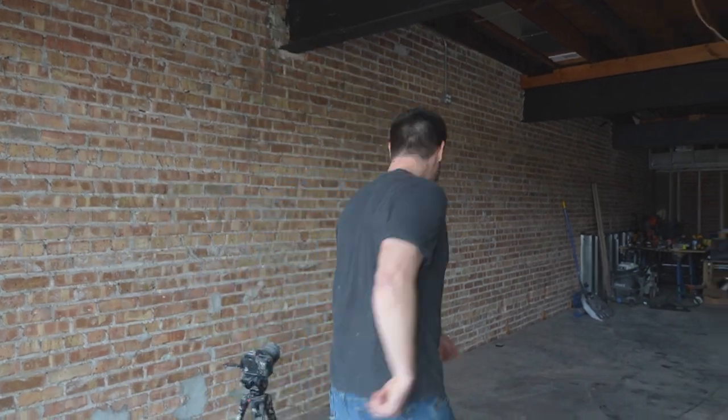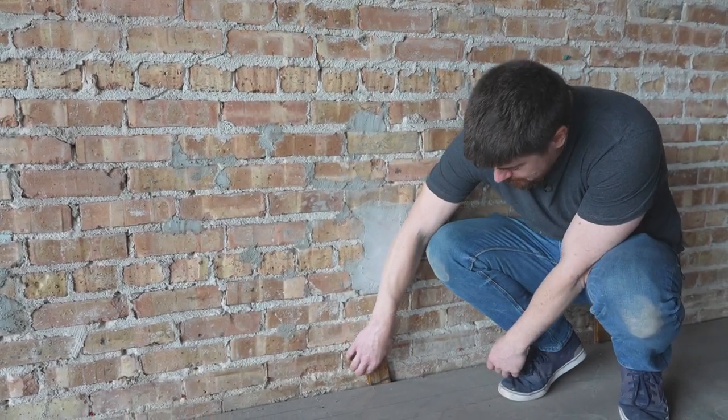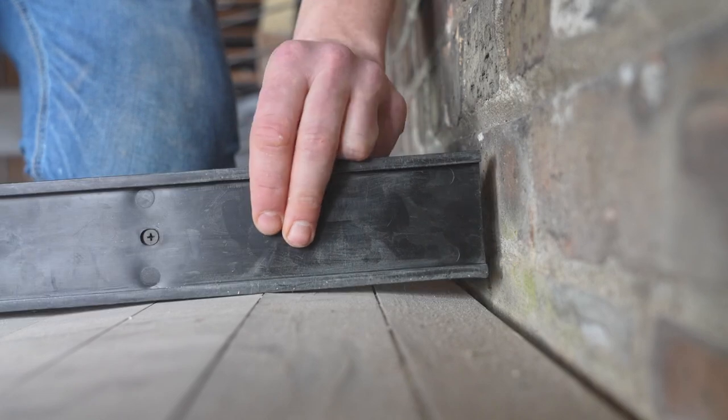Come look at this. They used a piece of the three-quarter inch flooring as a spacer and never removed it — it stuck in there. So any expansion at all and it just started popping. It definitely popped a lot. There are spots where there are huge humps in the floor.